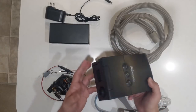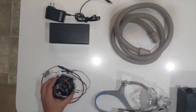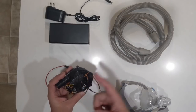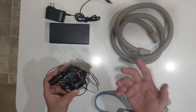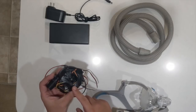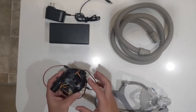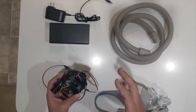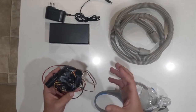I have a few of these old CPAP units because I'm really interested in what's inside them. It turns out that the blower is simply a standard brushless DC motor which can be driven by a standard electronic speed controller found in quadcopters or RC cars, and it can be driven by an Arduino. Having this control means I can modify the software to change the speed of the blower to meet whatever profile I want, and this is what enables the CPAP motor to function as a partially capable simplified ventilator.